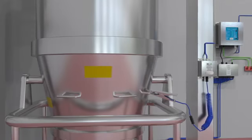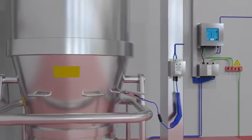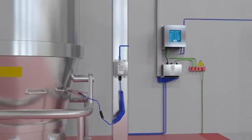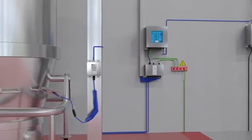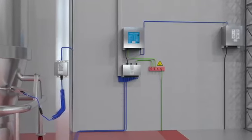A combination of localised visual indication and flexible interlocking capabilities will prevent the process from continuing without each monitored component having a reliable connection to ground of less than 10 ohms, ensuring a safe procedure is followed at all times.